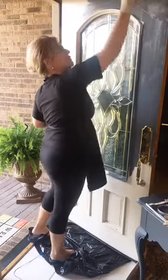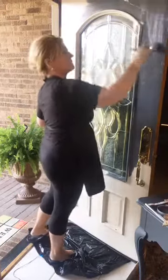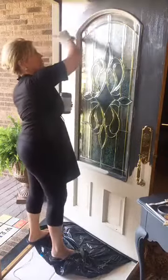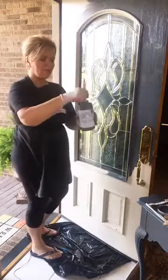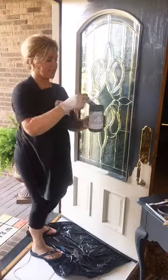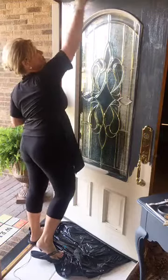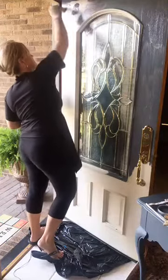You're going to go back, even if you've used our foam applicator. You guys have seen us using the True Applicator sponge. Put on that first coat with a True Applicator, not a problem. You're going to go back over it with your top coat in a liberal coat with a brush. That's going to give you the flow and the coverage that you need in the second coat.